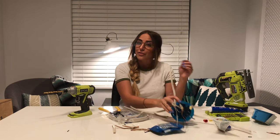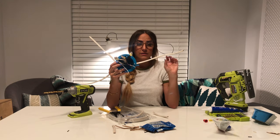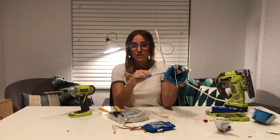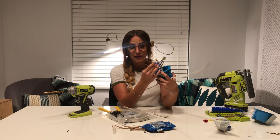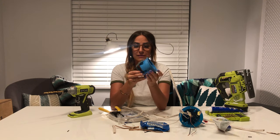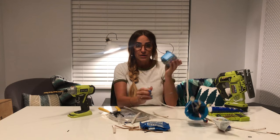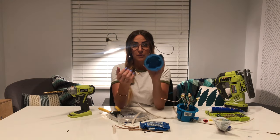Repeat that step on the other side if you're splitting your one light to two others to have three total. You'll be cutting holes through your drywall and fishing your wire through the holes of your studs and out your existing hole. By that step you are pretty much on the home stretch. Take your Romex cord, push it through your new light boxes, and strip them down like you've already done so you have three wires ready to go for your new light fixture.